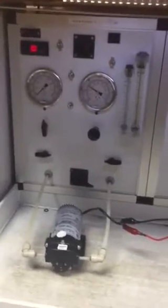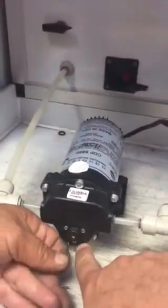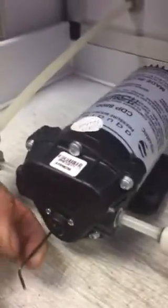So what we're going to do here is lower the bypass to your standard 60 psi. The 60 psi is how we normally build your pumps. And the way we do that is there is a set screw here on the bypass with a 1/16 inch Allen wrench. We turn counterclockwise, which brings the little screw out.